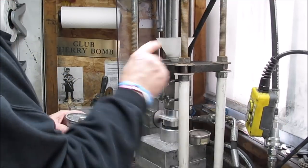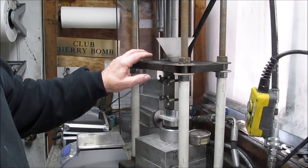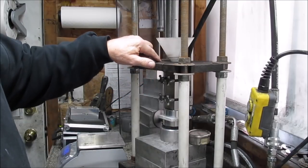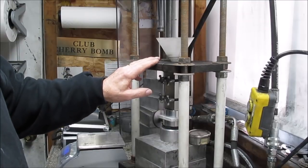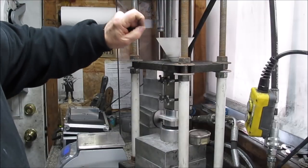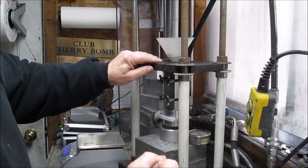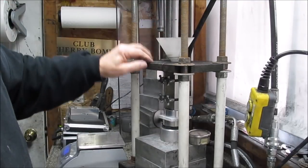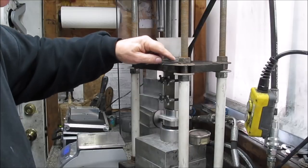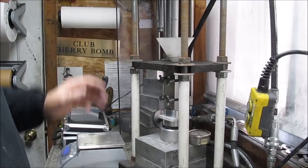One thing I thought I'd mention — I made this bridge out of plywood. I had pondered having Caleb machine one for me out of aluminum. If I was going to use an aluminum bridge, I would still want a Delrin insert inside the bridge somehow. I never want to be able to pinch whistle composition between metal and metal. I wouldn't want this bridge being metal all the way going into the funnel and all the way to the tube, just in case I could catch some propellant between this three-quarter-inch ram and the bridge. So I either want to use a wood bridge or an aluminum bridge with a Delrin insert that keeps this ram away from the aluminum bridge.